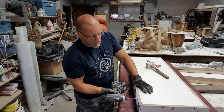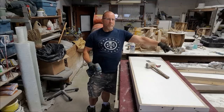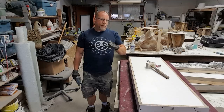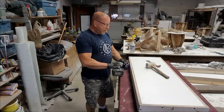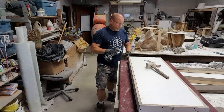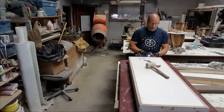A small thin pry bar and a rubber mallet could come in handy. I just want to mention I flipped this by myself this morning on the boards, and I put it on a piece of plywood just with a piece of carpet on it. I like it to land on something soft. I put a board underneath it to catch it. If you've never flipped something this big by yourself, I strongly suggest you get some help — they are really heavy. You could get seriously hurt or injure your hands, so just be careful when you're flipping it upside down.